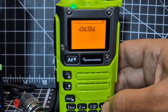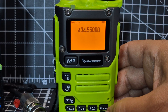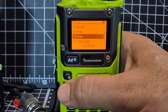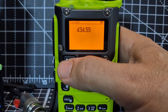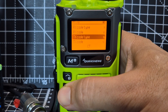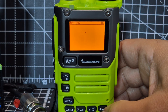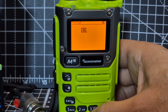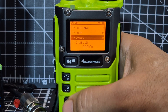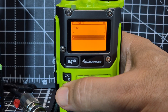We need to put in more noughts — there we go, all noughts. TX frequency, receive frequency. Then go down to offset — let's go menu. So we'd go nought dot, and then six zero zero, menu. Then transmit offset direction, menu — go minus.